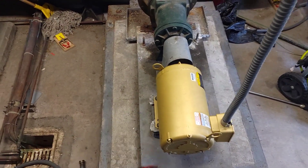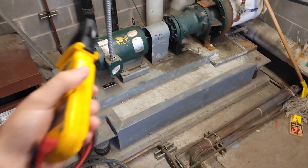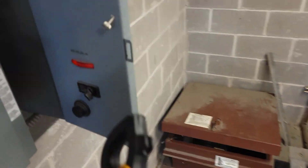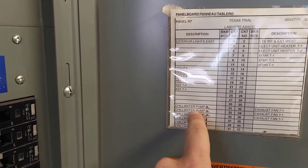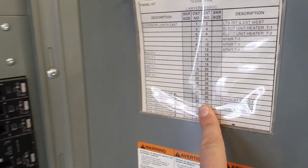This is an older motor. This motor got replaced because it was starting to get weak on the windings — we may have a similar issue here. Regardless, we do not have power coming into this disconnect, which pipes over here. Chilled water pump 2 is 31, 33, 35.